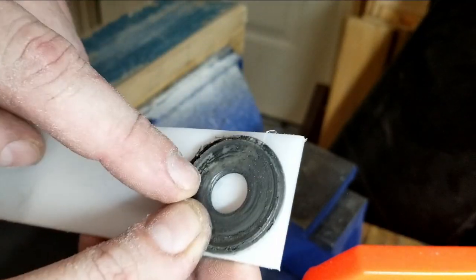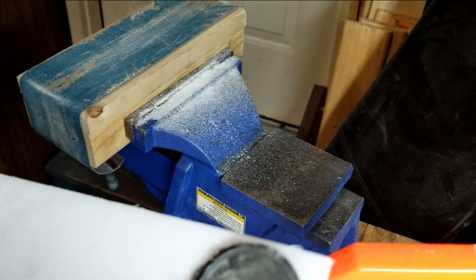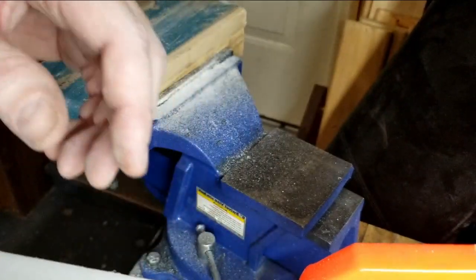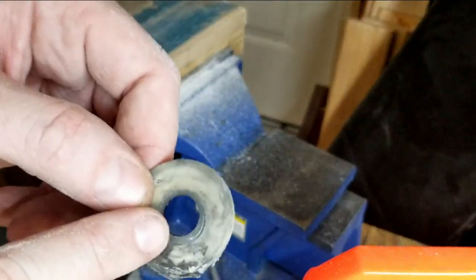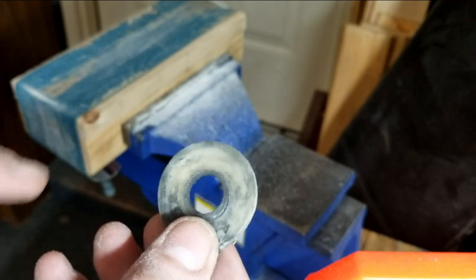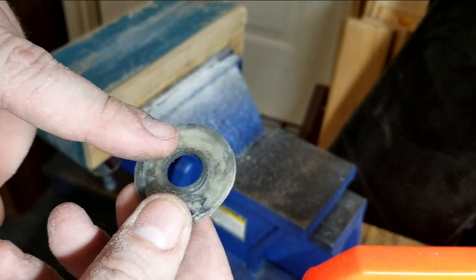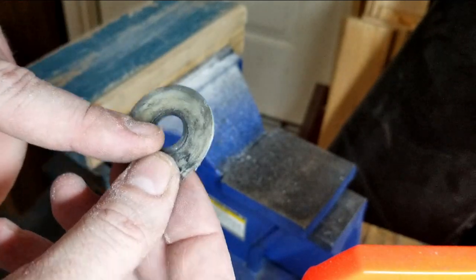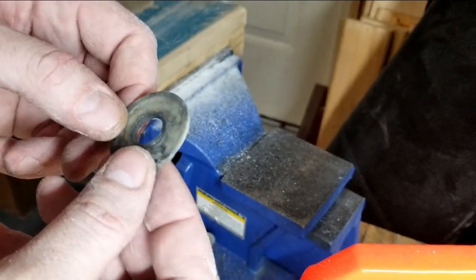And I think I got a drill bit that'll fit there. If not, maybe a step bit. But I'm going to cut straight edges first so that I can make those holes, I think, just to make life easier. This inner diameter hole is just a little more than a half, and my step bits go from a half to 9/16, and my largest drill bit is a half. So we'll try a half and we'll re-drill it if the half isn't good enough.